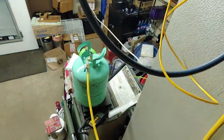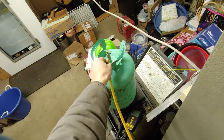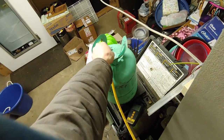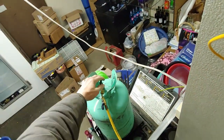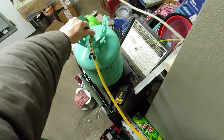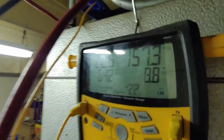We're going to add in a little R22 and see what it does. We're just going to bleed a little air out first, open this valve, make sure the others are closed. We flip the tank over — the gauge is zeroed — valve is all open, so now we can go ahead and add.